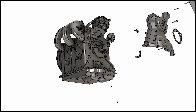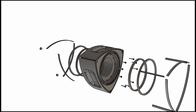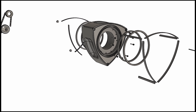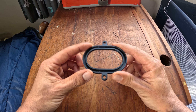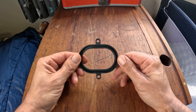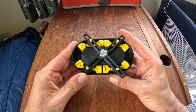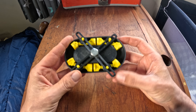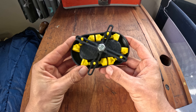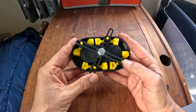Let's look at a Wankel or rotary engine and see how they've got theirs sealed using a complicated array of seals, which works well. These engines get a lot more RPM than a piston engine, but they actually still vibrate quite a bit — they usually have two rotors to balance themselves out. The key is you need an ellipse shape so you've got two lots of expansion and contraction to push the exhaust out and force in the next fuel-air mixture. So then I came up with this idea: it will spark up the top, expand, expand, boom, push the exhaust out, and over here it can suck the next lot of charge and repeat the cycle — four times per revolution.